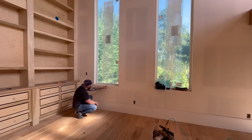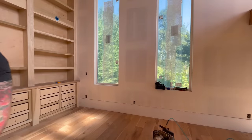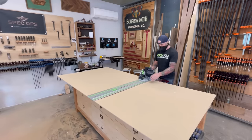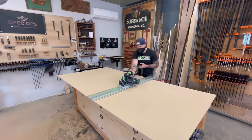With all the baseboard installed, it was time to figure out my panels. This is a board and batten: I'll put quarter-inch MDF panels on the wall, then have vertical battens running from the baseboard up to a top trim piece. It's important to figure out where your seams will land so they'll be covered by a batten. I knew I'd have a batten centered under each window, so I started with the windowed wall — it's more complicated but I already knew exactly where my seams were going. With all my measurements I headed to the shop, pulled out my track saw, and started cutting down some MDF — well, once I actually had batteries in my saw.